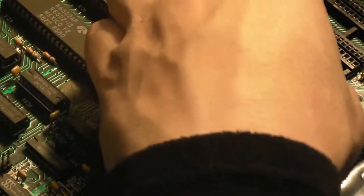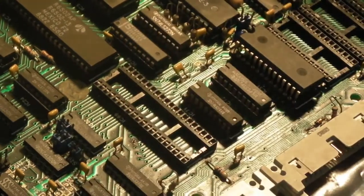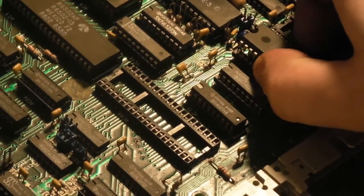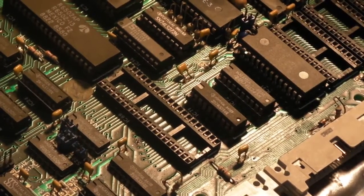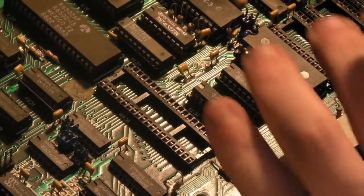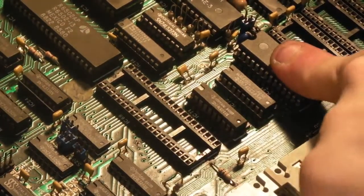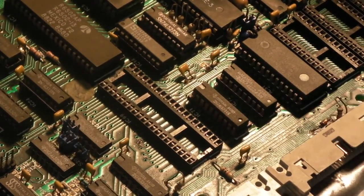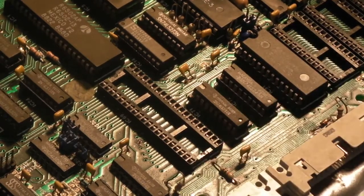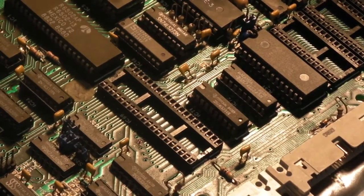The only problem with turned pin is, you have to be a bit more accurate with how straight your pins are. You can get away with a bit more undulation on a standard socket than you can on a turned pin, but for actual contact and what have you, a turned pin is far, far better. Oh, that's a really nice tight fit in that socket. It properly pushed and clicked home. It's a much better fit in the socket than those old single wipe ones like these. I will probably end up swapping these out with a better socket as well.